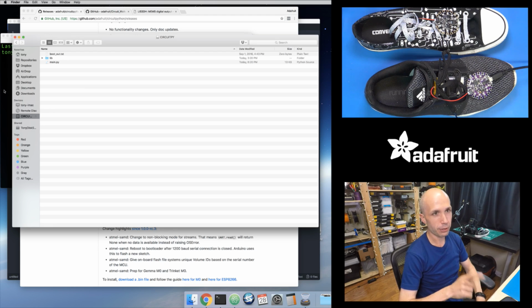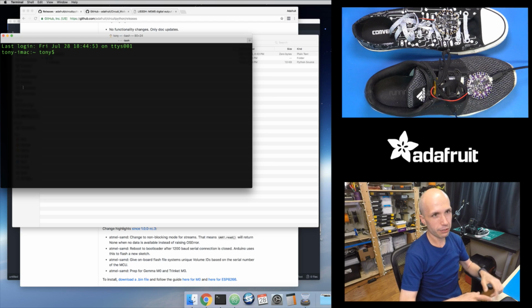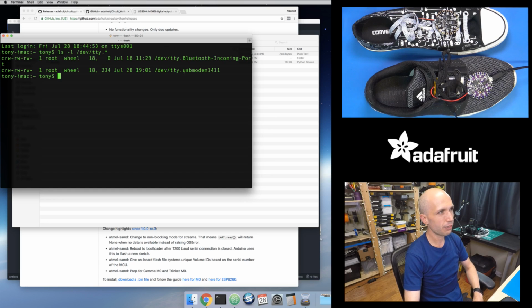But you can see your code here, but it also shows up as a USB serial device, or as a serial port on your computer. So I'm going to access that serial port from my Mac. And from your Mac, if you're curious, you can list all your serial ports. If you list everything under the tty.star path like this, this is going to show devices.